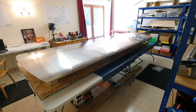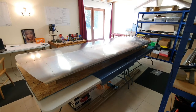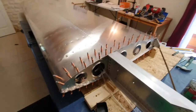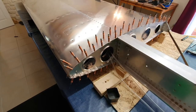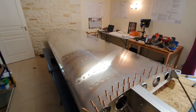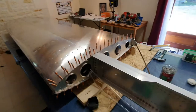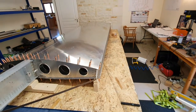All the flush rivets are in and done, so basically we're at the wing box complete stage for the right wing. All the flush rivets have gone in okay, not looking too bad dimpled in. The only rivets we can't put in at the moment are the ones for the doubler strengthener at the root, which can only be done when we actually fit the wing to the fuselage. So there we go - one right wing, just have the aileron and flap to make for the back end and also fit the wing tip.